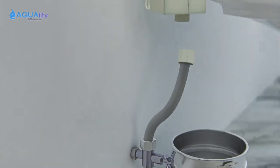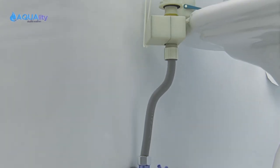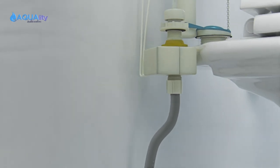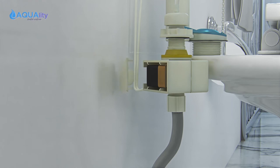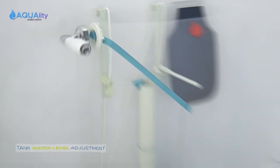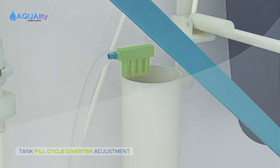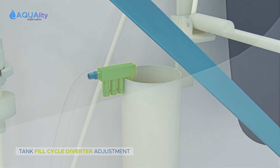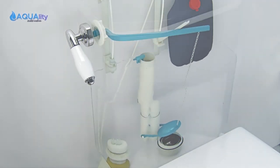Now it's time to reconnect the supply hose and turn the water supply back on. Then connect the battery, positive post down. Slide the overflow sensor below the overflow tube. Adjusting the diverter determines the amount of water to the bowl. Be sure to adjust the flush tilt switch slightly above the flush lever, pointing upward on the flush cycle.